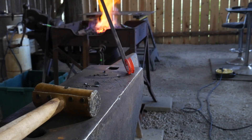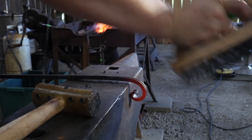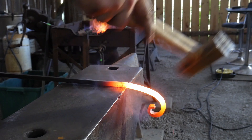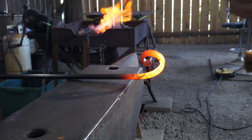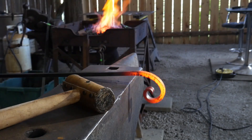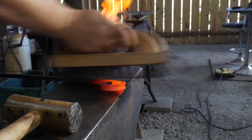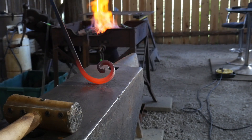This goes for any of the decorative scrolls going forward — any decorative finials that are more than just a ribbon end or snub end scroll. You're really going to want to focus on using softer mallets and wooden mallets to keep those edges crisp as you scroll things around. It's all about being intentional with your hammer work and making sure your hammer blows are being placed in appropriate locations. Once you get beyond the actual fluting, you can go back to using your regular hand hammer that has a little extra mass, which allows you to push things around more readily — and that's okay then. But you definitely want to get past the decorative element portion of the scroll first.